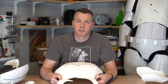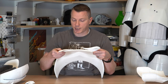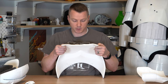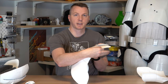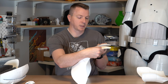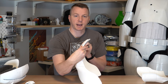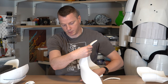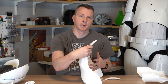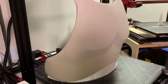One of the important things I learned while building this was that the angle you place your model at makes a big difference as far as what supports you do or do not need. Here's a broken chest plate from my first attempt. If you imagine it printing flat, you're going to need supports under certain areas — that's a lot of wasted material. But if you rotate it, you really don't need supports for most of the angles, which is really nice. Be very considerate about what angle and rotation you choose.